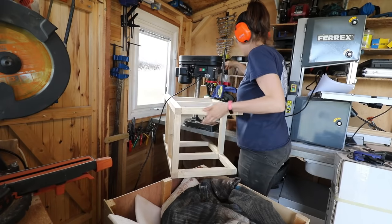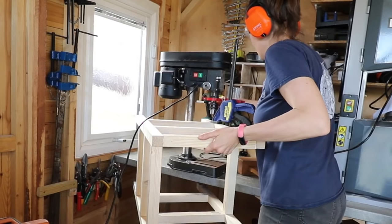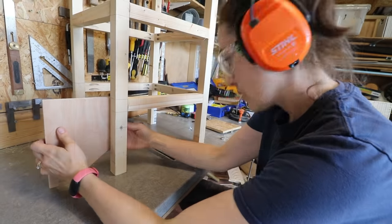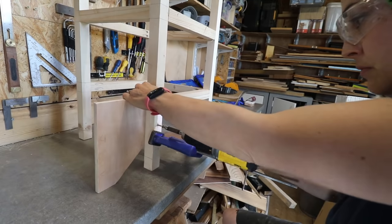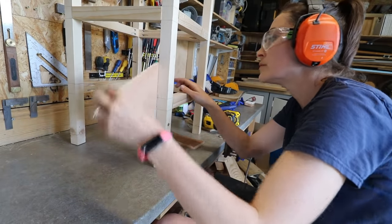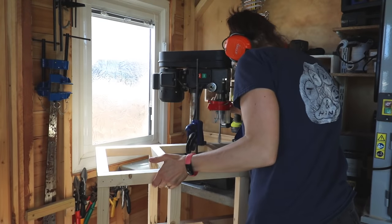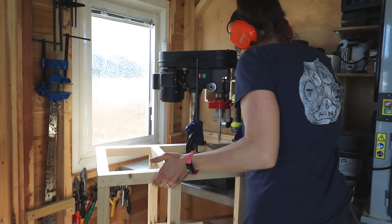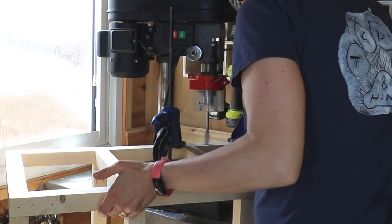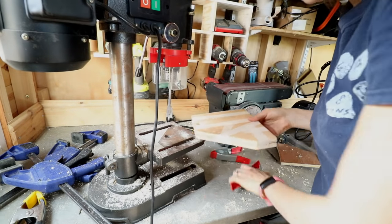I was inspired by a YouTuber called Fisher's Shop — I'll leave the link below — where he used this dowel technique and I had an offcut, it just made sense. And because I needed this to be right, as a test I first drilled centre with a small drill bit, then offered up my two side steps to temporarily screw to the frame, allowing me to check it first before I went for it. Once I knew it was okay, I used that small drill bit hole as a placement for my 18mm flat wood drill bit in the drill press. And because I already had a screw hole in the two sides of the small step, I could use it as a reference and drill straight through them together.